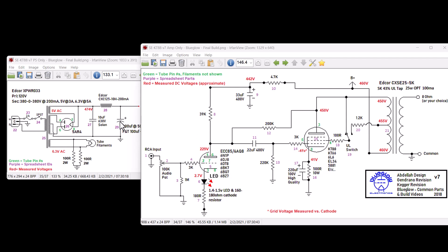If it's still blowing fuses even without the output tubes in, turn the thing off, get out your multimeter, and start checking things with no tubes installed. Is the output transformer shorted? Check resistance from one end to the other — look up the specs on the Edcore and check DC resistance across the winding and from each side to the center tap. Check pin 3 to ground for shorts. Start measuring across resistors: put your multimeter on pin 4 and the other probe on the other side of the resistor at the switch — is it still 100 ohms?